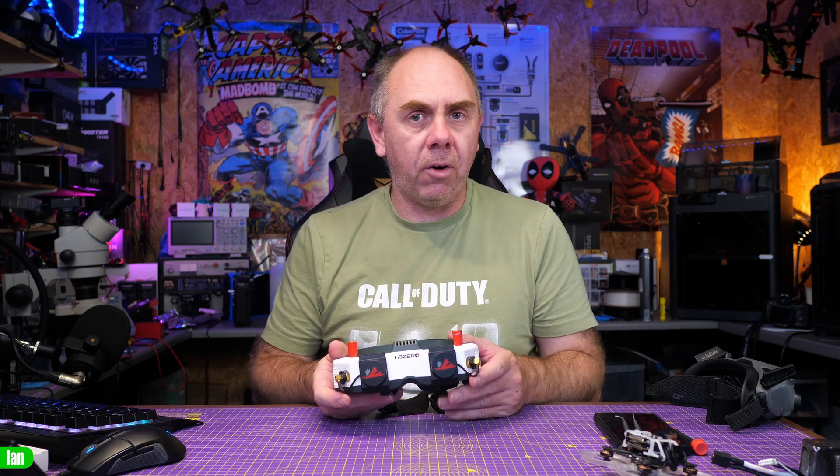Last week, I put out a video on the HT-Zero goggles showing a quirk that will cause them to reboot when using them with Crossfire. To cause it, you have to bring your Crossfire remote over 250 milliwatts either within a few inches of the goggles or close to the power cable. This only happens with 900 or 868MHz systems — the HT-Zero goggles are not affected by any 2.4GHz system at all, whether that be ExpressLRS, Tracer, or any of the others. It only happens with 900 or 868MHz, but that could be ExpressLRS, Crossfire, or any other 868 or 900MHz based RF system.